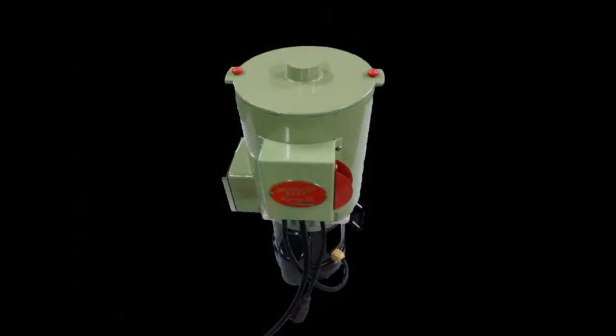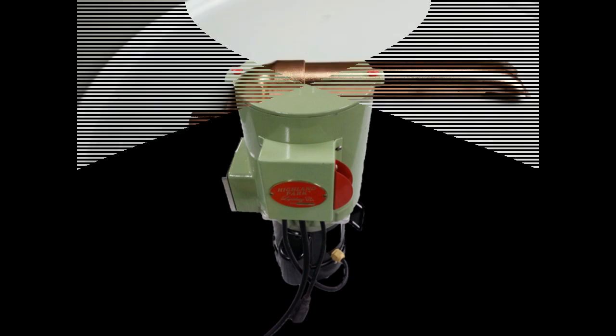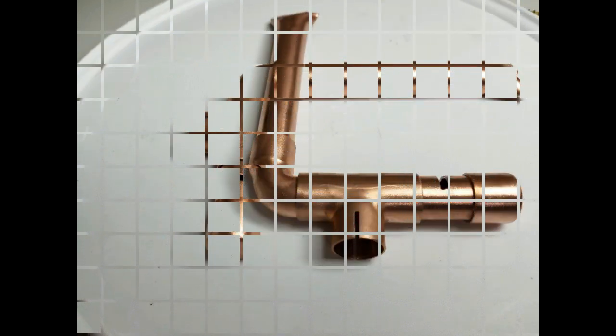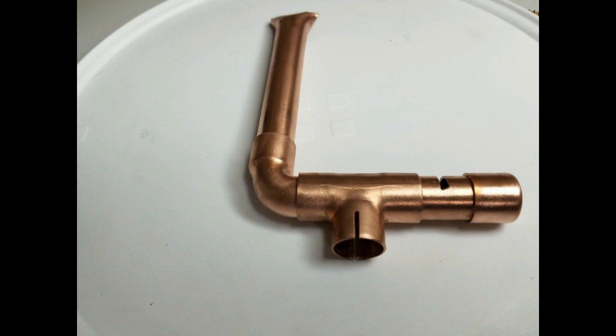At that point, I started looking around at a better way to clean the oil, and after some investigation, I found that Highland Park Lapidary makes an EverClean system. This EverClean system works on centrifugal force with a can spinning inside that collects all the sediment that you would get from your saw. This looked like a good idea for me, so I purchased one. So what I had to do is come up with a way to return the oil back to the saw and lubricate the blade without having a large volume of oil inside the saw.